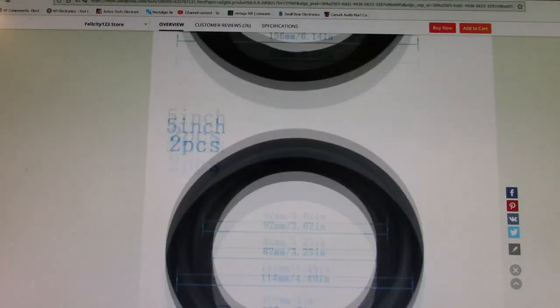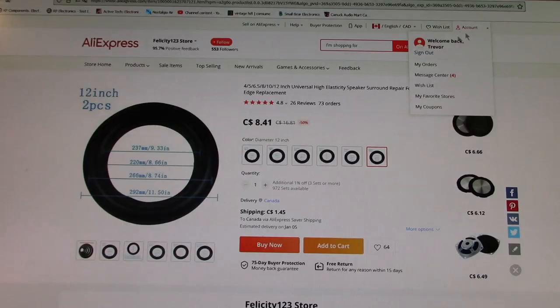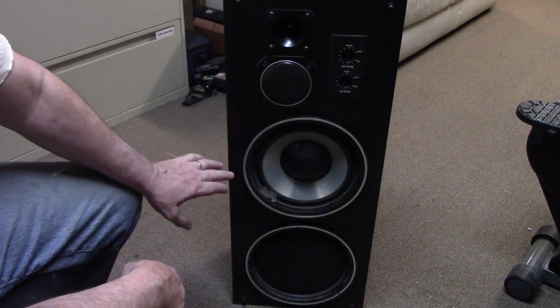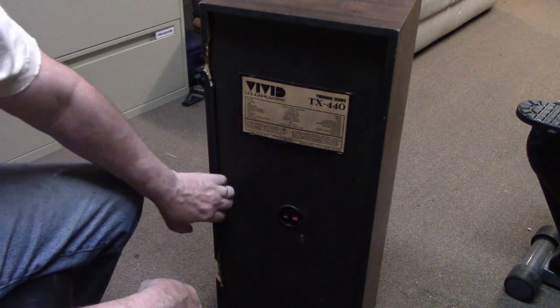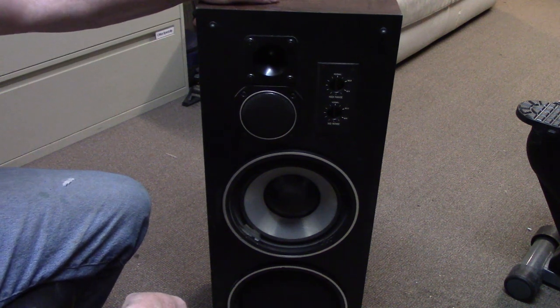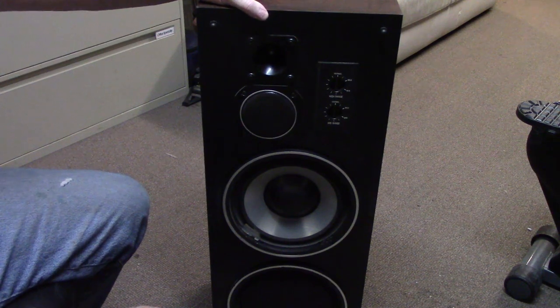When these come in, I'll end up refoaming them — I may not make a separate video on it since I've done a refoaming video before and it's pretty straightforward. So there you have it — a video on how to wreck a speaker! I'll get these fixed up, don't worry. We found a cracked split case, put silicone in there, and I'll also put a bead on the inside for extra strength so it won't pop at 110 watts RMS. Thanks for watching, Happy New Year, hope you have a good year in 2022, take care and we'll see you on the next one.